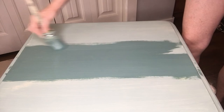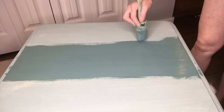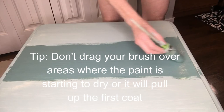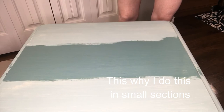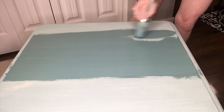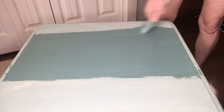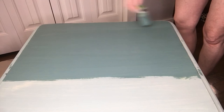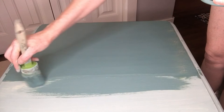I like to work in small sections all the way across the piece, and once I've got a section done, I just want to pull my brush straight across so all of the brush marks go in the same direction — that's going to make it look a lot more beautiful as an end result. DIY paint is high quality, highly pigmented, amazing paint. It is so super versatile, and that's why so many people love it. If you want to see other videos that show you how to use this paint for different techniques, make sure to check those out on this channel. And if you're interested in any of the products I used in this video, I'm going to list them all down below in the description.